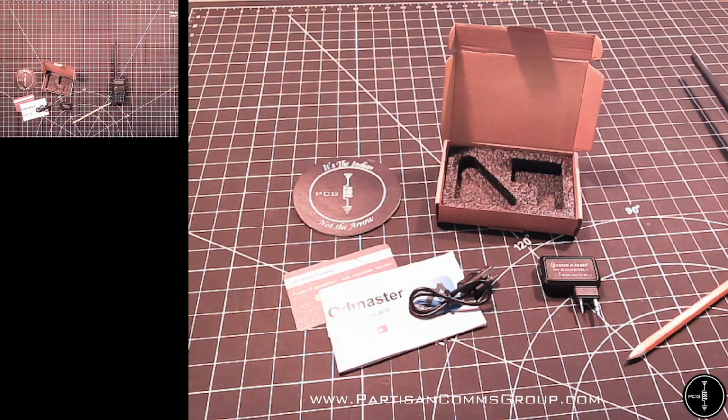In the past, when I wanted to take a radio with me on a trip, I would have to go through repeaterbook.com, and then I would search for repeaters in the area that I was traveling through. I would use that information to create the code plug in either Chirp or RT Systems, and then once the code plug was built, I would write the data to my radio from my laptop. And the process, if you go that route, can be a little labor intensive.